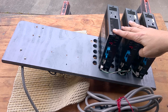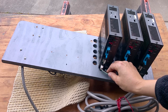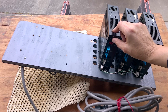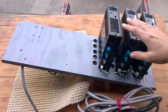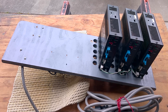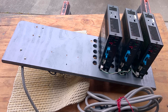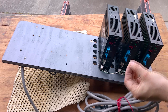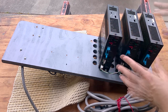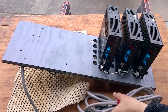I've got three drivers mounted — these are the proprietary five-phase drivers for the motors. They're cool because they have 110 AC input, output to the motor, and control connections with little adjustments for run and stop. What makes these great is the built-in power supply. Even with modern two-phase drivers, I'm surprised nobody makes a little case with a driver and power supply combined — that would be a good product. Marketing-wise this was a great idea: you bolt them on and they're ready to go.